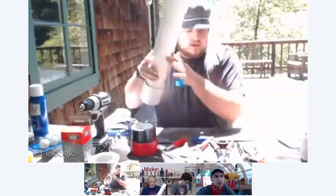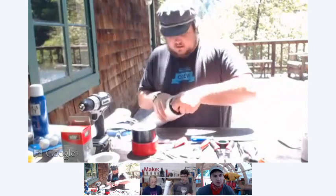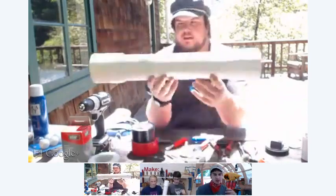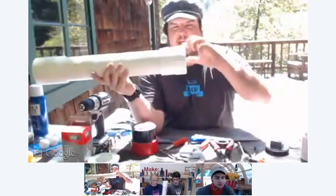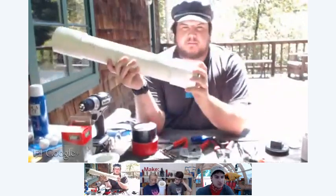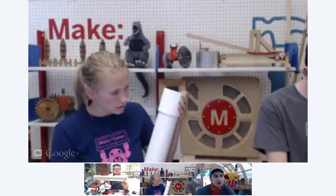Okay. Right in here. So we can use our end cap, like this is a clean out cap. So just thread in here like this. And then it's sealed. Do you have one of those in the lab too that we could see? Which part? The adapter part. It looks like the regular coupling, except it has ridges on it, which helps to get a hold of it so you can unscrew it, because sometimes the threaded part gets stuck. I don't know how well you can see, but we have one that's got little ridges on it. Yeah. Okay, cool.